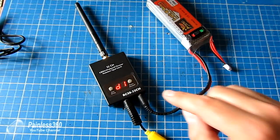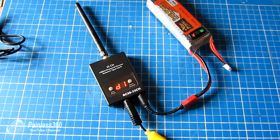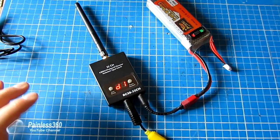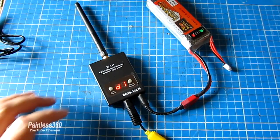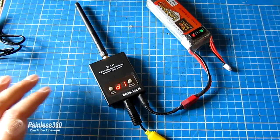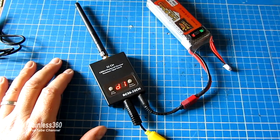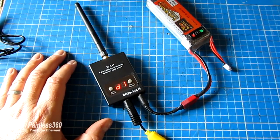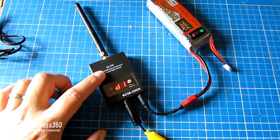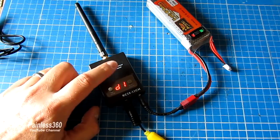Just be a little careful because some FPV frequencies used by BossCam, Fat Shark and others are very, very close. If you look at the diagram in the description that maps out all the FPV channels, you'll notice some are very close — so this may find a channel that looks great but won't give you the best range because it's actually 0.05 GHz off from where it needs to be. Now we need to plug that into a set of goggles, and we'll show this working with the camera and transmitter we've already looked at, but we'll also plug it into a Fat Shark system as well.